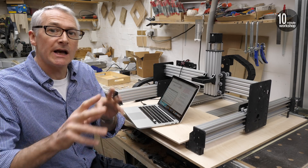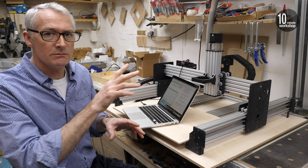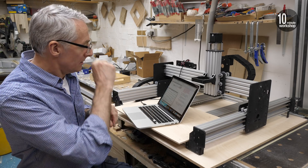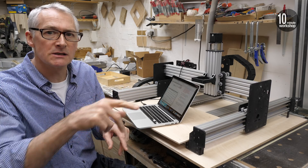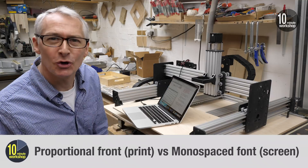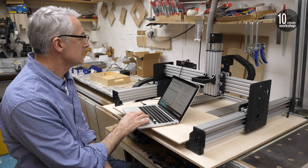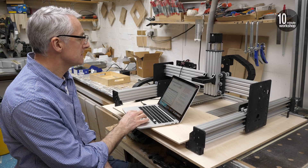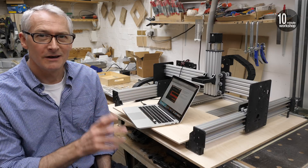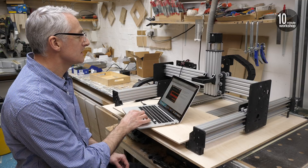The syntax of the text you type in is very specific. There are screenshots in the manual — you need to look at those because they show you where the spaces are. Early on I was typing IS instead of LS, because it's not clear what it is, but it's much clearer in the screenshots. Anyway, we are connected and we do have an IP address. So the next stage is to try and connect using that IP address.